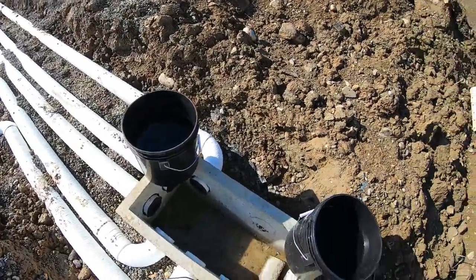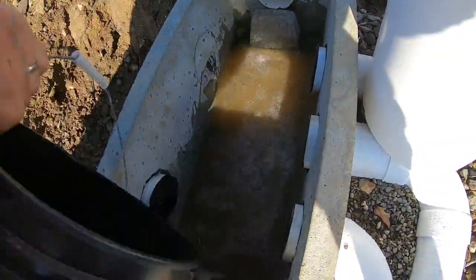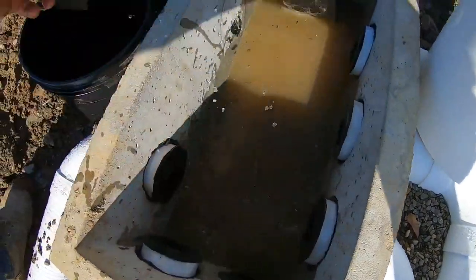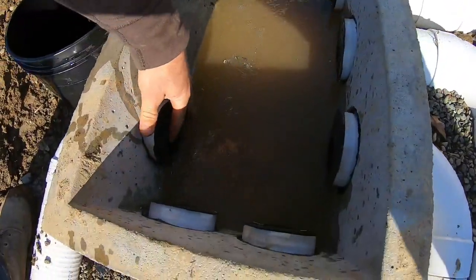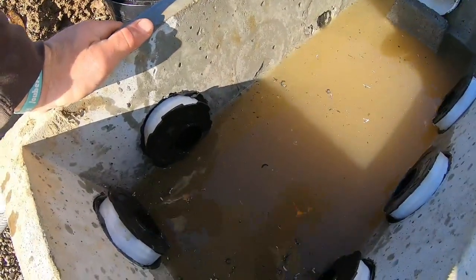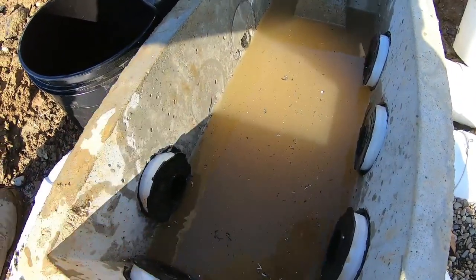Inspection went well. So what we are doing, take your water, dump it right on in. You're gonna adjust these speed dials. Hang on, I got some debris in here I don't want going down in. Hopefully they got enough water here. All right, once you get her up, adjust these. Put them all to the bottom first. All right, and they should all take at the same time, just the way they are. And I knew they would because my box is dead level. But you just adjust them in case one's a 16th off. You see how that's taking very so slow. They're all good. And you just let that water drain out and then do it again, do it twice.